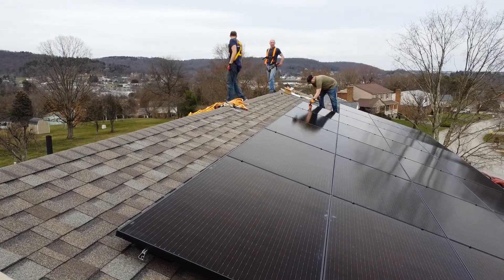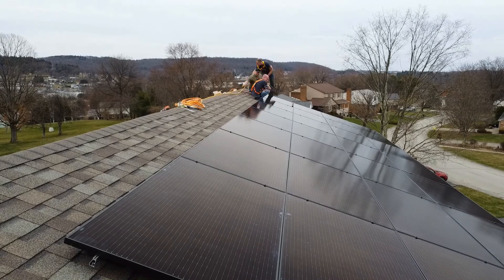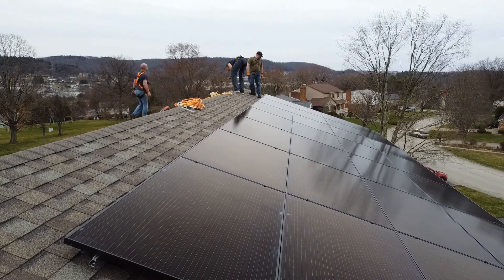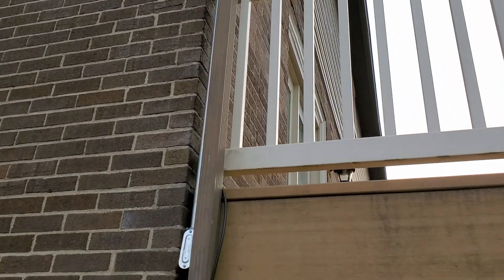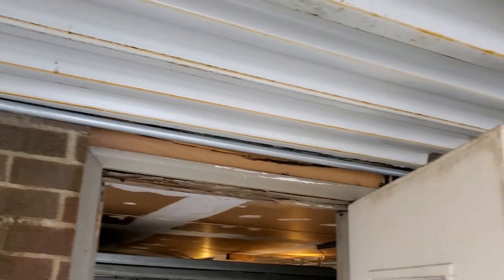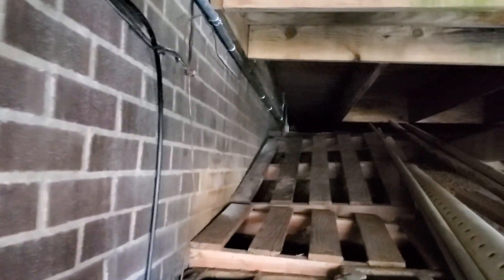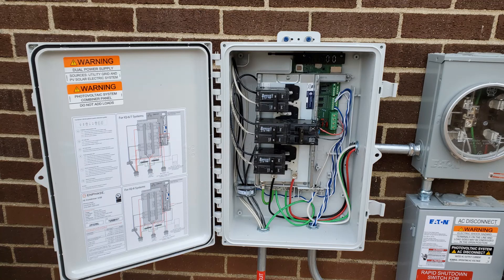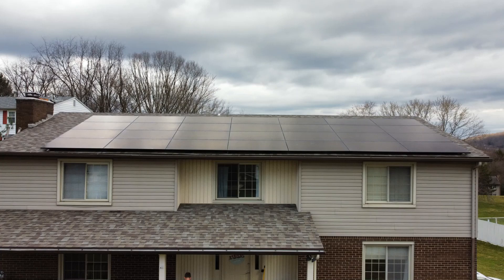Overall the solar panel installation went as I expected and I'm very happy with the results. My neighbor who is an electrician helped me do all the conduit running, attach the meters and panels, and do all the wiring. We ran the wiring through the solar deck, across through the attic and out the soffit fascia, down the corner of my house, under the porch — all through a three-quarter inch EMT. I couldn't have done this job without him and I appreciate all the work he put into it. It goes up through the porch to the AC combiner, over to the solar meter and down to the AC disconnect, then down to the basement to the main meter and attaches through a line-side tap. I hope this video was helpful to you and if you like and subscribe you'll see updates in future videos.